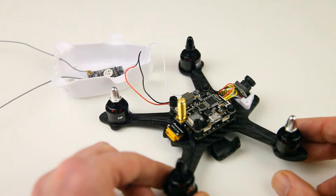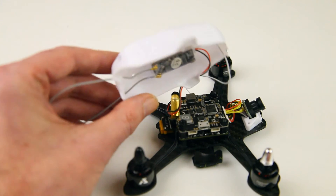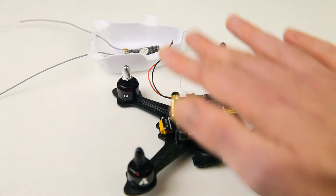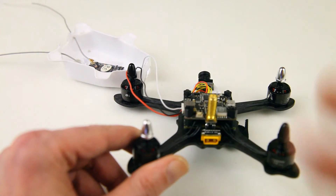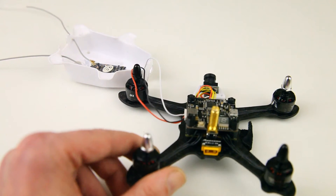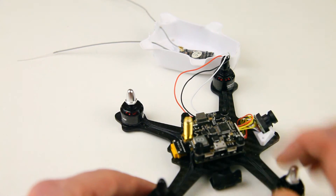You can't access the display with the canopy on, and the same goes for the USB connector on the side — you'd need to cut a small slot into the canopy, or do your setup with the canopy off. At the rear you've got an XT30 connector — a smaller version of the XT60 more common in quadcopter land. I just took a couple of LiPos and soldered on XT30 connectors. I tried it on 3S once, then flew exclusively on 4S with a 750mAh pack, and the quadcopter seemed pretty happy with that.